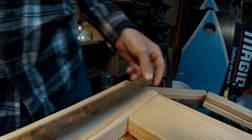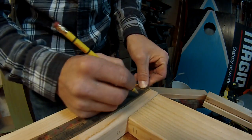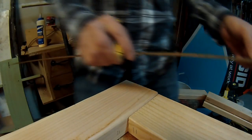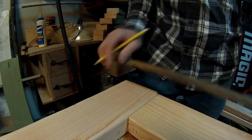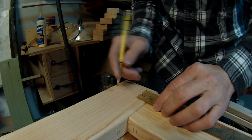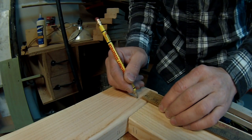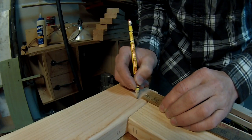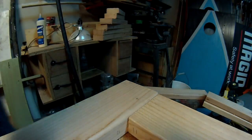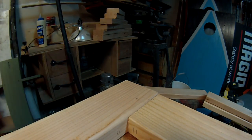First thing you're going to want to do is go ahead and mark your spots where you're going to be wanting to make the main hole. Mine was halfway up in between the 2x4, which is 1¾ inches, and then off of the edge of the 2x4, I went 7/8 inch. And I'm going to be using a 1/2 inch Forstner bit to drill this because it's a lot shallower, which gives me less of a point on the Tenon.